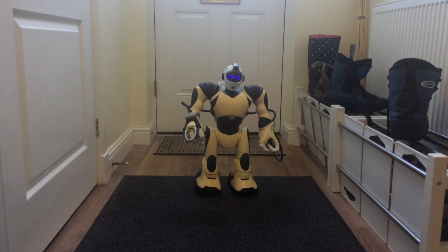The big problem with these robots is the wiring in the legs — the insulation sheds and causes short circuits. So I've rewired his legs, so we'll make him move forward at slow speed.